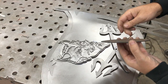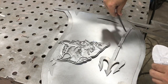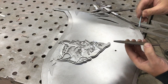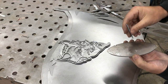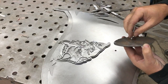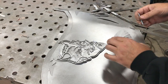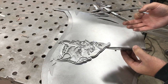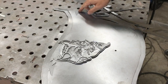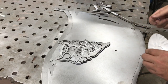All right, so I'm going to have one bolt in the center of the devil head, and one bolt that's going to go through the front and back layers of the football, both of the pitchforks, and then both layers of the flag. You can see that has 6 layers that you end up going through. So this will be it welded to the back here, and we know that it goes roughly in the center, but a little bit higher than center. And on this particular placement, it doesn't really matter a lot. But some things, where you're going to bolt 2 layers together, like here and here, you need some way to mark it and keep your orientation and all that correct.